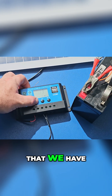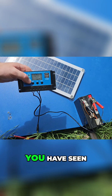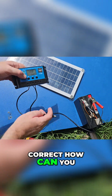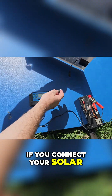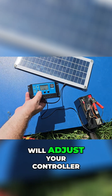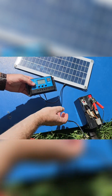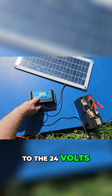This is indicating that we have a 24 volt battery setup, but this is a 12 volt battery. In the previous scene you saw 20-something volts charging that 12 volt battery, which is not correct. If you connect your solar controller to the panel first, it will detect 20 volts and adjust to the 24 volt range. Then if you connect the battery afterward, it will still show the charge controls and limits set to 24 volts.